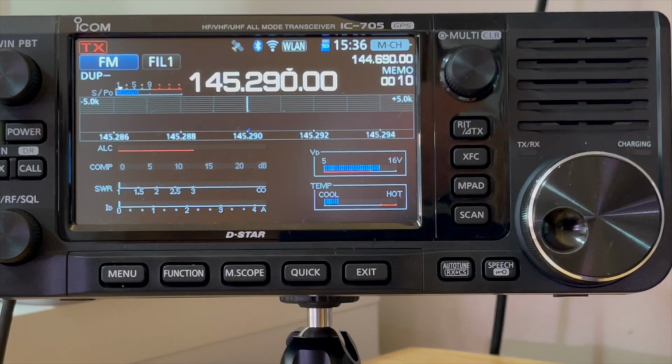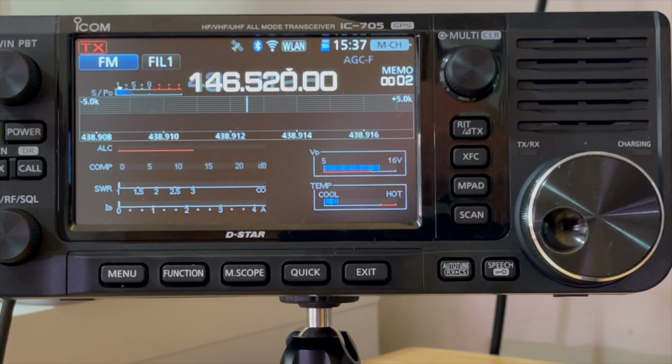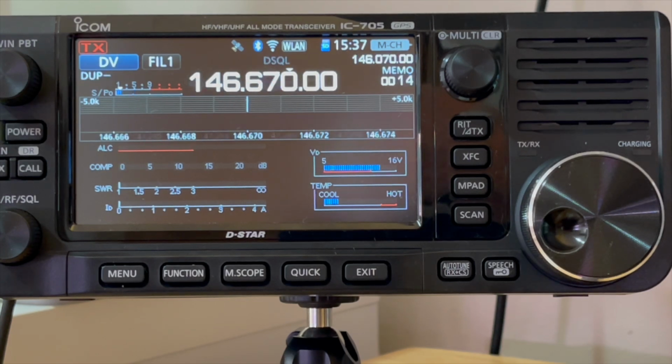As you know, ICOM provides a big list of DV repeaters from all over the world. So it's just a matter of loading this file. If your unit is missing, you can get this from ICOM Japan. There are 4 files, which I'll show you, that you need to copy and where they go. It's also important when you're importing the files off the repeater book that you select repeater, and also when you load it on the ICOM, you select repeater, which I will show shortly.